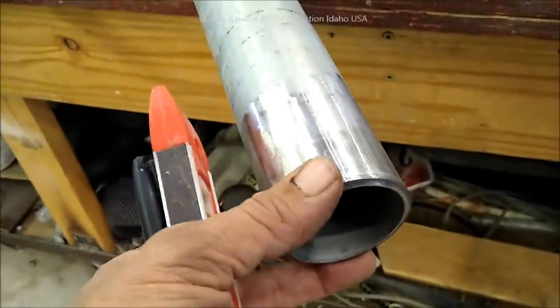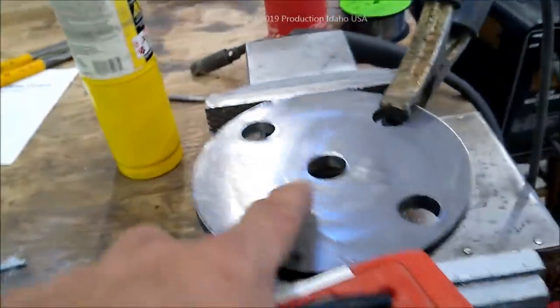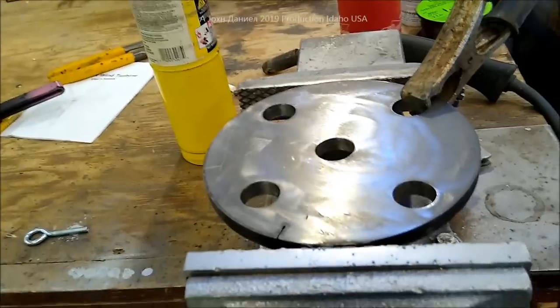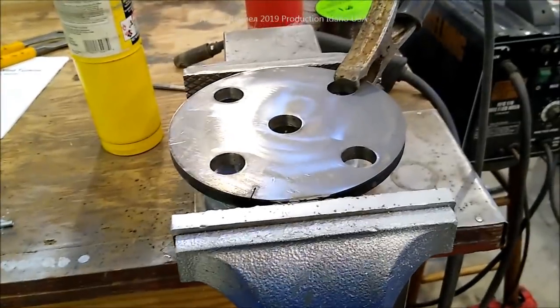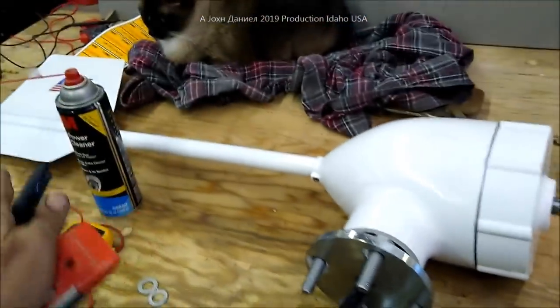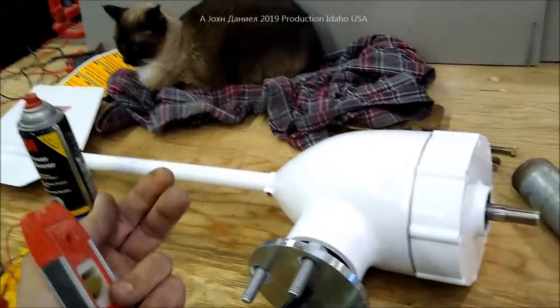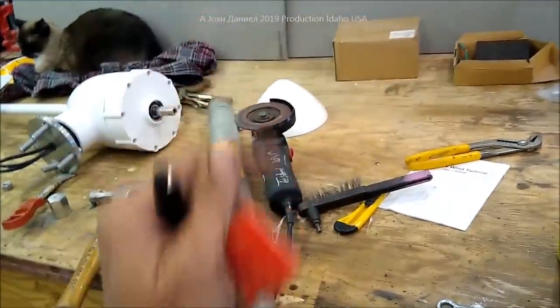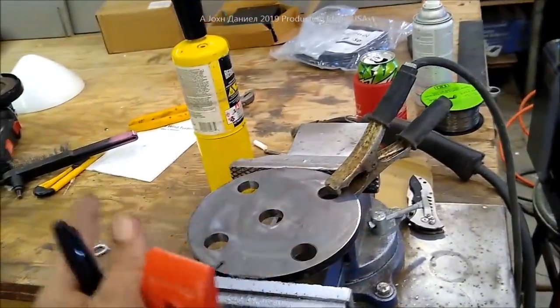The piece of pipe was cut with a pipe cutter — a tubing cutter. When I'm done I'll clean the galvanize off, stand it up, check it for level, and spot-weld it on. The end result is a perfectly level pipe. You want that because if it's off at all, it's going to cause the tail to swing around and follow gravity. You want the pipe perfectly plumb so the tail is easily gathered by the wind and put in line.